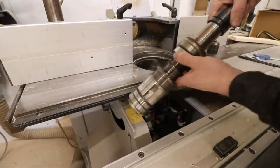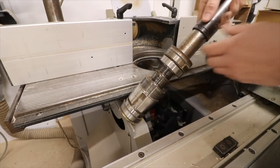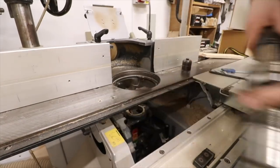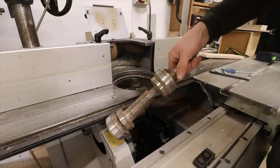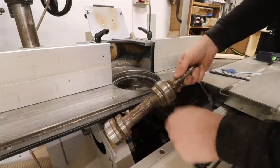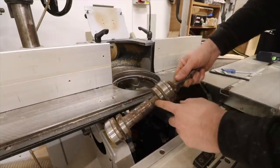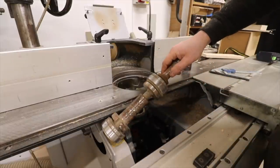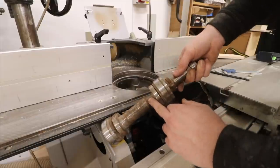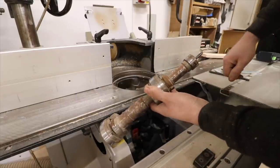Belts, that's the three speeds. So you can change between the three speeds. Then obviously the spindle sticks up above. Pairing that to my well-used router spindle, covered in rust. You've got one speed that runs on the quickest pulley of the spindle moulder, and it's a really small turned shaft on this, so that I get 15,000 RPM, which is a little bit quicker than the other spindle can go. And then you've got a router collet on the top.